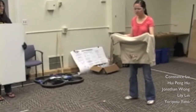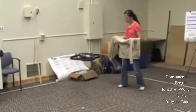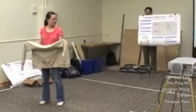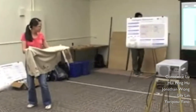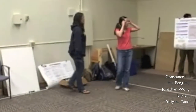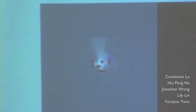Go forward two meters — usually it will approach Constance but hopefully it won't. As you can see this is Constance. It drifted a little bit — oh no, it's going to hit the projector? It's fine. This is the path it planned. It will go forward and land. As you can see it drifted quite a bit and control was a little off as it moved towards Constance. But it sort of followed the path it originally planned. It detected Constance as a wall in the map, and detected Lily over there too. This is the wall of people, and this is the big open space it sees. The range finders have a range of only three meters, so it's not able to see the other wall at the end.